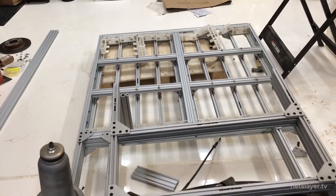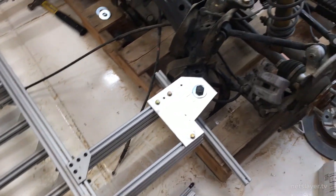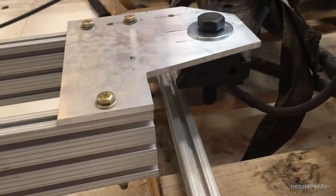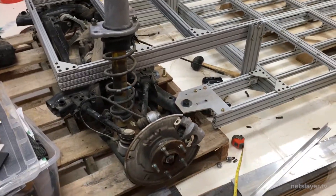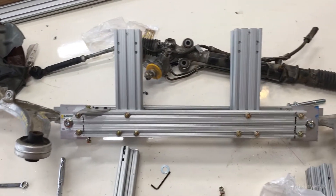Passengers are going to be boarding from the rear of the vehicle, walking up the middle. There's going to be a small shelf platform sitting on top of the Miata subframe, and that's going to be bolted to the platform. The Miata subframe - the piece you see here in black - I used to connect to the rest of the vehicle using big holes and bolts, so I decided to repurpose them to connect the platform to the subframe using big pieces of aluminum sheets. This gives me the flexibility to take off the platform from the subframe whenever I want.